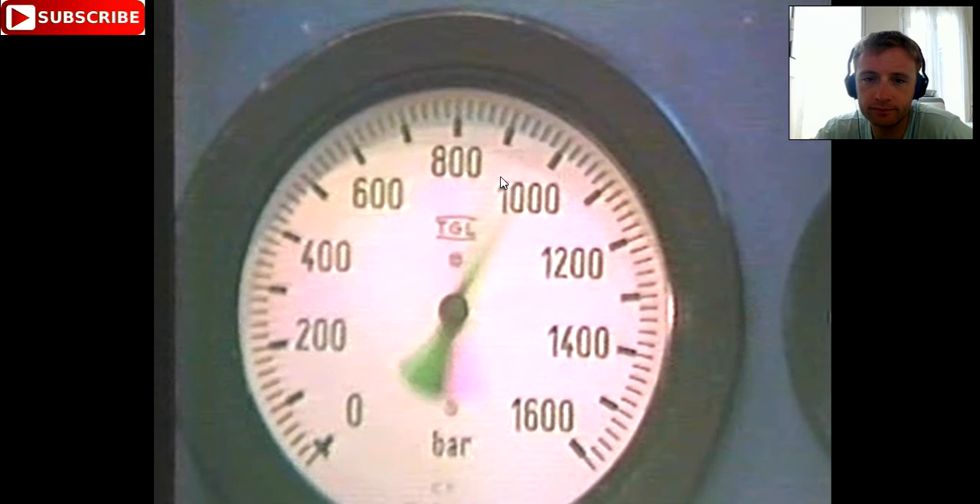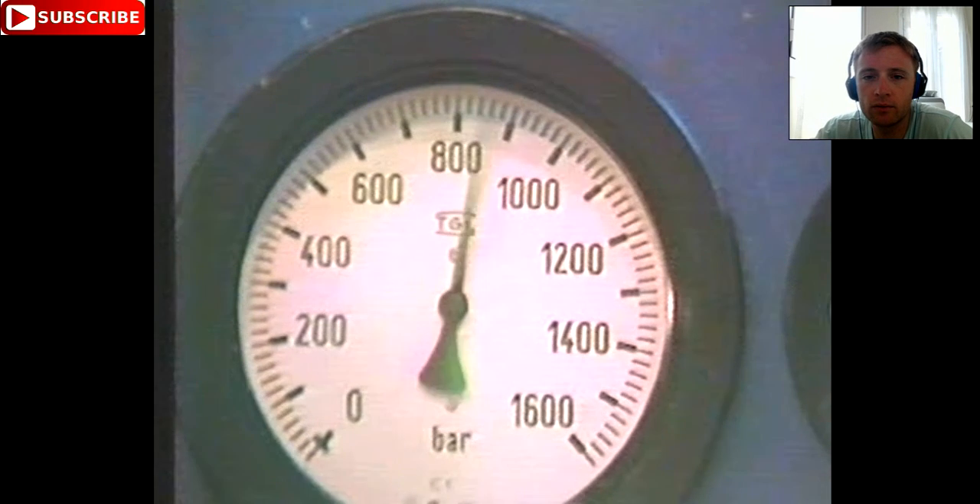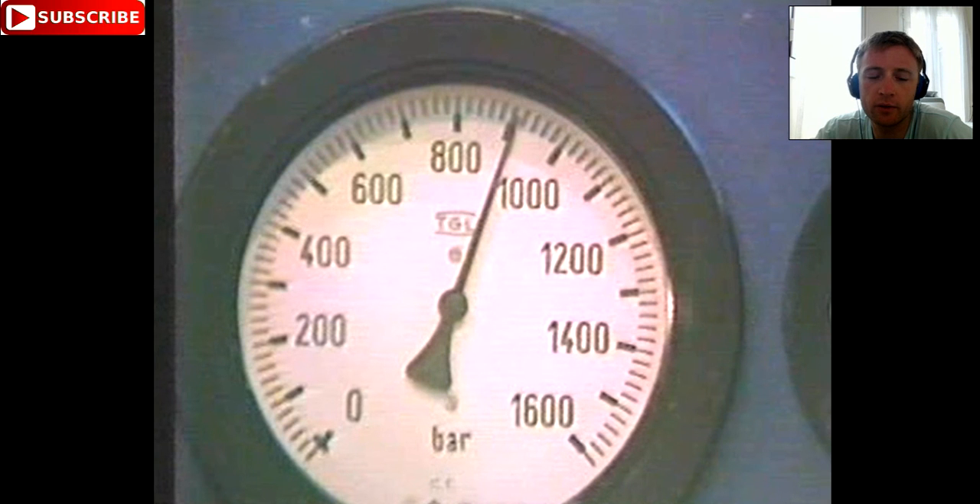For me it is better to start pumping slowly and then increase, checking each time for any leakages. If there is any leakage, stop immediately and replace that component. Use your hydraulic equipment slowly so you can avoid any overpressure and overstretching your studs and hydraulic systems — use with care.